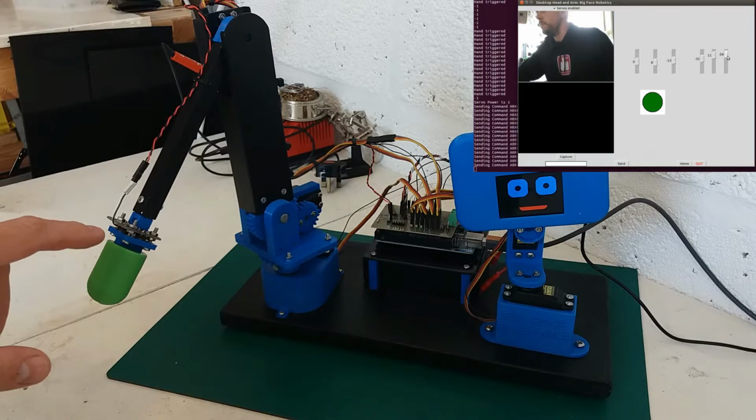If ever I was going to use a gripper on the end of this, I'd have to either redesign this elbow joint, as I'm calling it, or upgrade the servos to something a bit stronger. That wouldn't be a bad idea anyway, because they are struggling at the extensive movement, but for what I'm going to use it for, it's no problem.